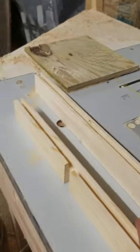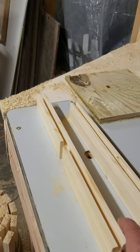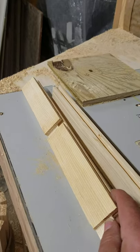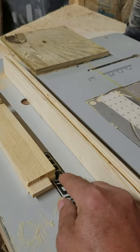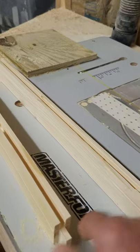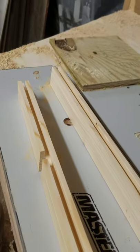I'll then take the shorter pieces that you get off of your front plates on those deep boxes. These are an inch and a half wide — you get an inch here, an inch lip here, and then that half inch depth. I'll take all those 16 and a quarter inch pieces and cut a central channel on there as well.